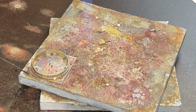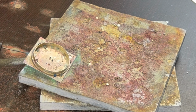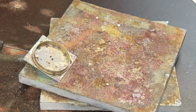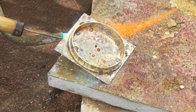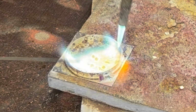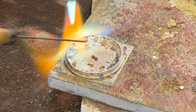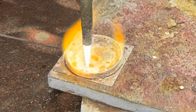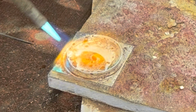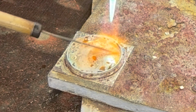Okay. So let's get this thing warmed up. I might do a little heating from underneath on this one because it's such a big bezel. Like I said, I'm just tilting it up a little bit until that solder starts to flow. Kind of gives you a little heating advantage to get things going. When you first start soldering something like this, the bezel is kind of exposed and up on the top and easy to melt. But we can prevent any of that kind of stuff happening.